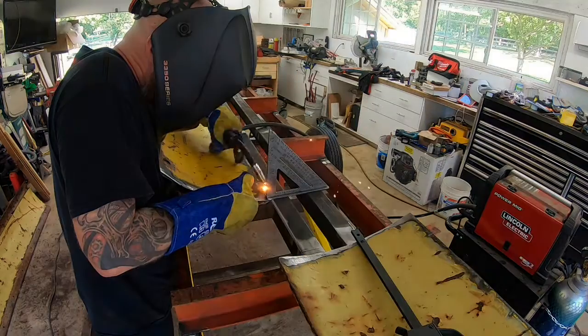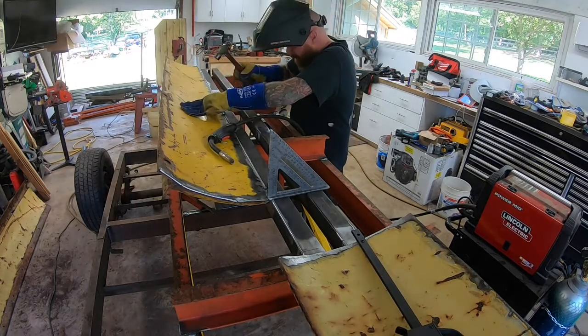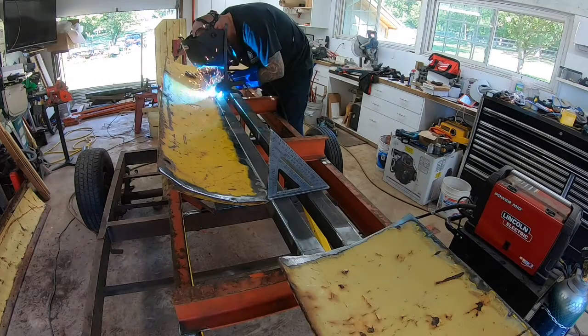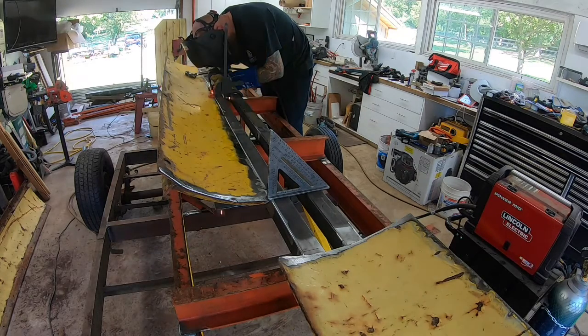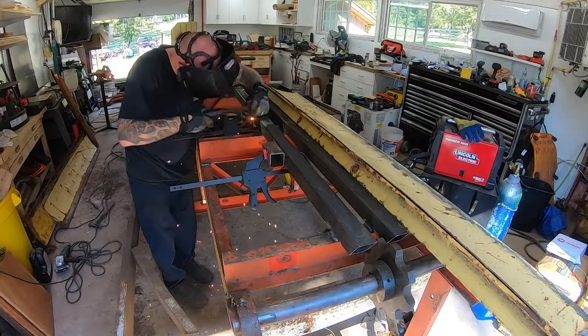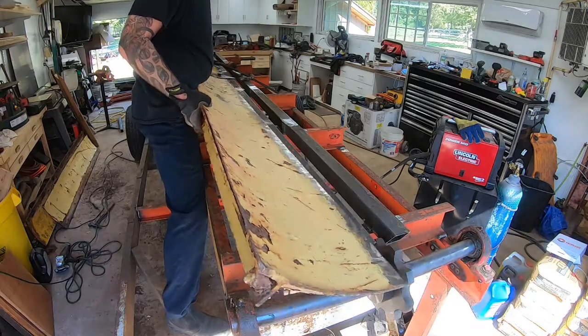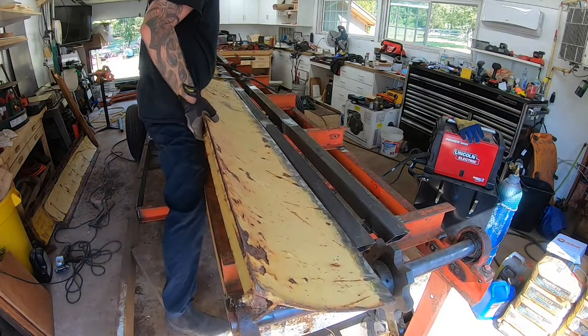At the splitter end, I set the plows back 1 inch from the face of the splitter. That way I had room for the saw. And the angle pieces that come down around the back, they were fully welded around on the square tubing, except I left a little gap at the bottom of each in case condensation or anything like that got into them.